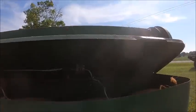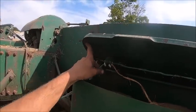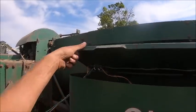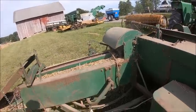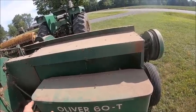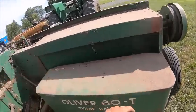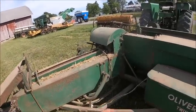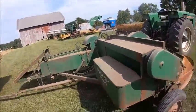So I took that twine, the far ball, out of it, and just have it running through the twine guide. And so now they're both running through a single clamp. So in theory, they're tensioned evenly, and that basically solved the problem. Since I did that, I think it broke 2 more because the knotter problem switched sides. So I played with the tension on this side a little bit. It basically quit, and then it broke 2 in a row, and this side switched twine balls, which this side's about ready to switch too. So it'll probably break a couple more, but